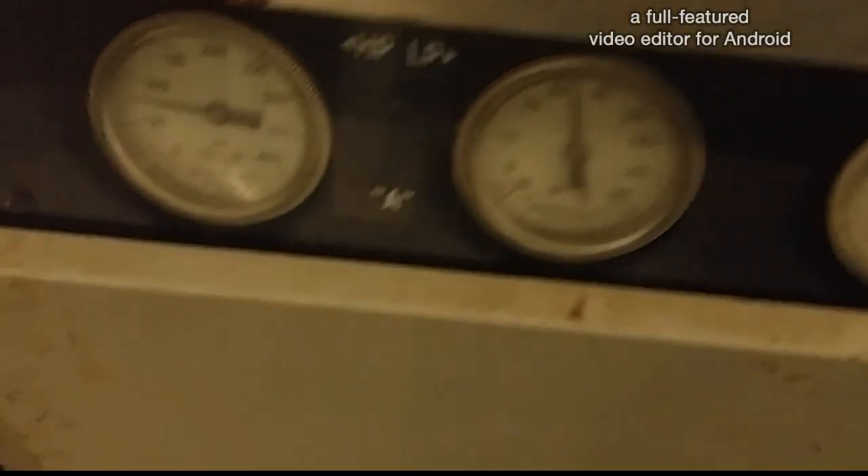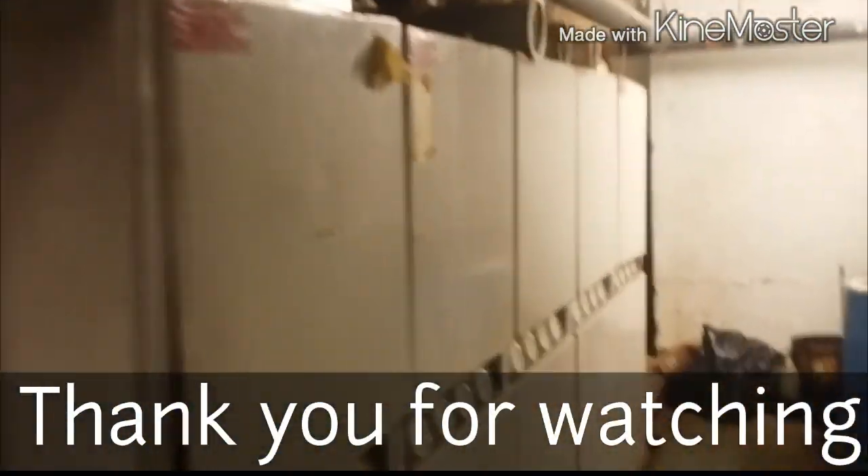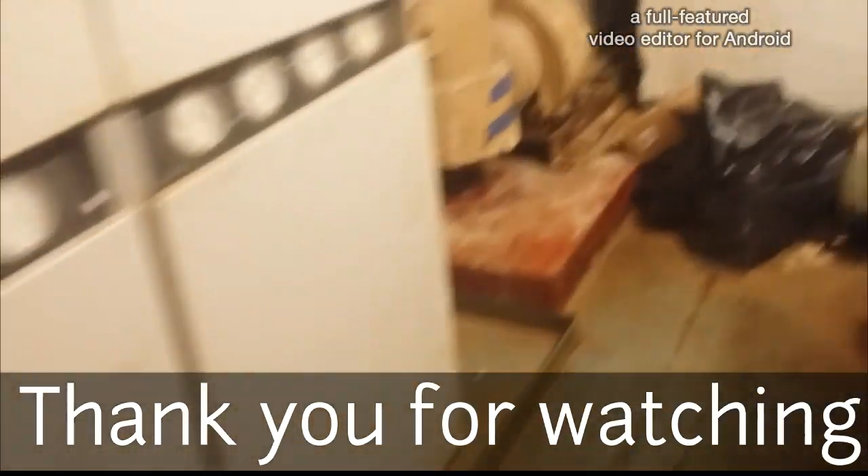I noted it was low on gas. If there's an issue with any of these compressors, it'll come up on that controller — it'll tell me. I don't need to connect gauges on. I mean, I have gauges right here — high and low — that's all. If we have an issue, it'll tell you everything. That's it. I'm going to put those strainers back, connect this Victaulic fitting there, and do the same with the other one. Thanks for watching, guys.